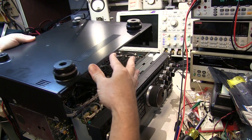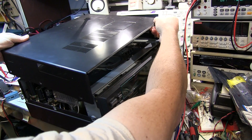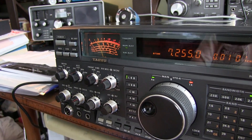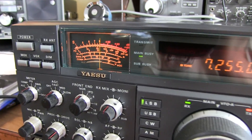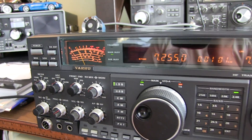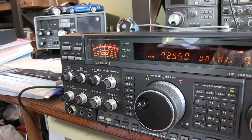We reinstall the bottom cover and screws, flip the rig over, and put the top cover back on. Up in the shack the receiver looks like it's working normally on 40 meters. Checked the other bands as well — signal levels compare well with my reference radio. I think that relay was it. Thanks for watching; if you liked what you saw, give a thumbs up, subscribe, and we'll see you next time.